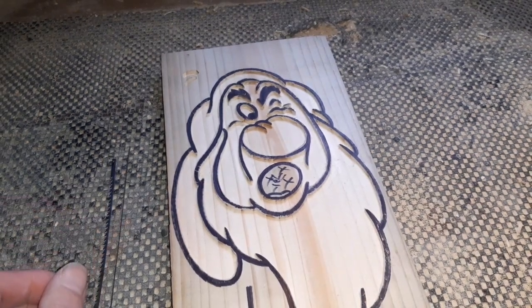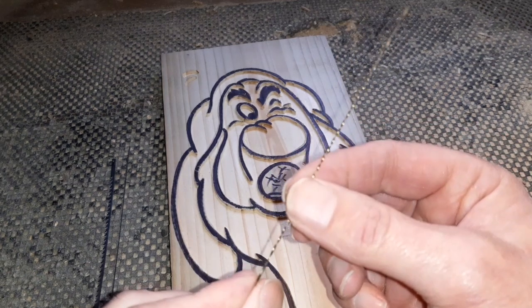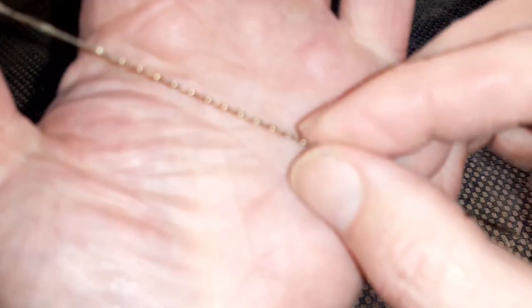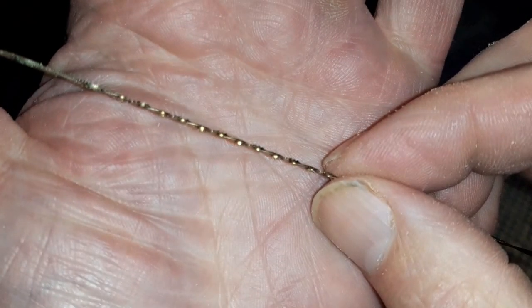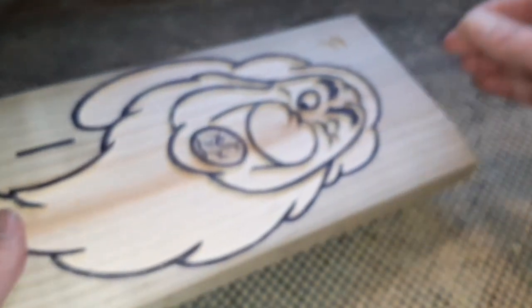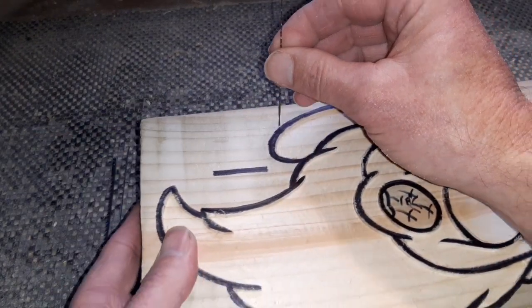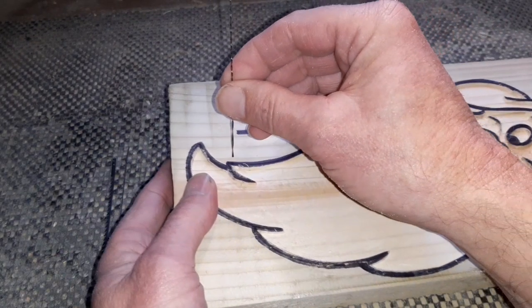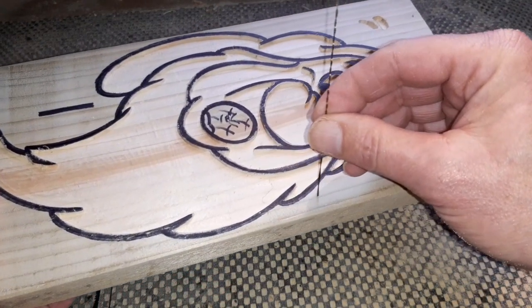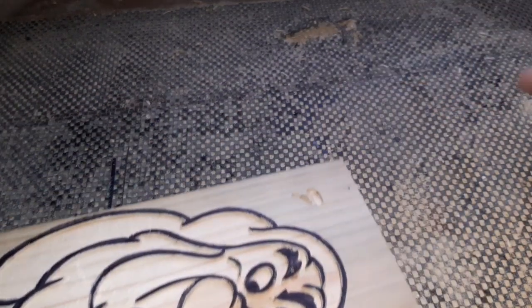So there are two types of blade. Me personally, I like the good old spiral blade. Pegas number 5 today. The good thing about spiral blades, the teeth are spiraled the full length of the blade, so that way they cut in any direction. So you can basically start there and just feed the wood and cut it like that without moving or turning the wood. Ideal for bigger projects. They take a little getting used to and folk either love or hate them.